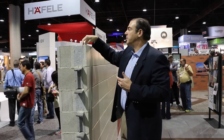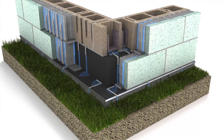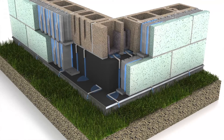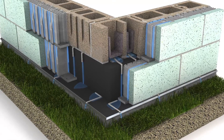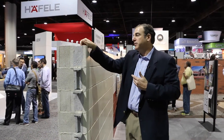The other part of it too is the water mitigation. We've got a lot of details to show you how to design this wall system and how to mitigate any water penetration into the interior. So if you're worried about single-wythe construction, have that discussion and we'll show you how the system works really well with our Rain Block system to mitigate that.